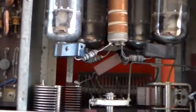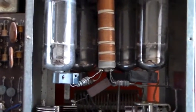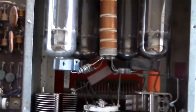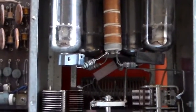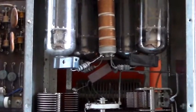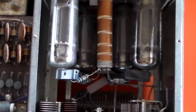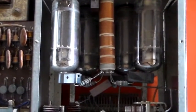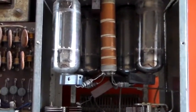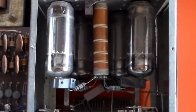What I'm going to do is get all the dust out, then check the windings on the heater transformer to make sure it's been wired in series correctly. I'll put it on a variac and take the anode caps off the valves first, then wind the variac up and make sure the heaters come up okay and the HT comes up okay. The reason for removing the anode caps is that valves don't like anode voltage being applied without full heater voltage. If it's all good, I'll put the caps back on, put some drive into it, and see if I can get some RF out. Hope you enjoyed that — thanks for watching, catch you next time.